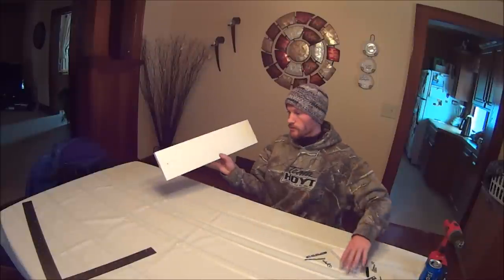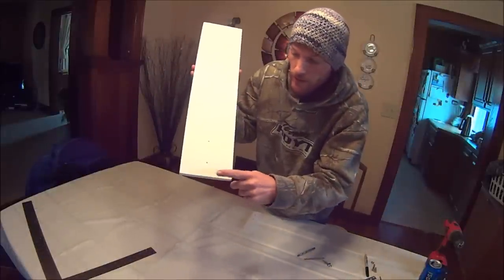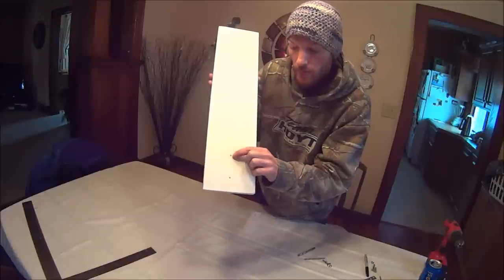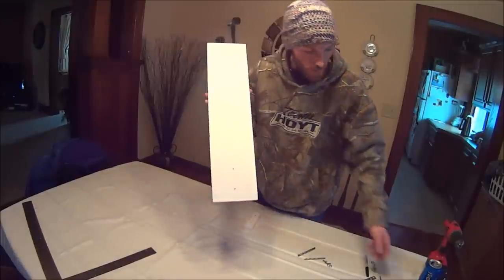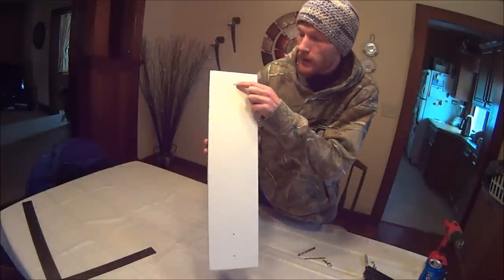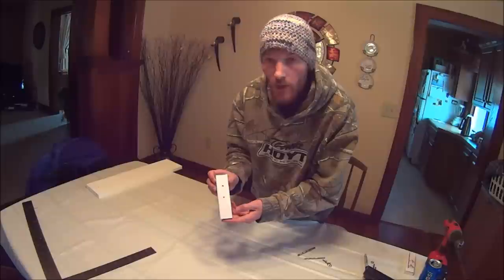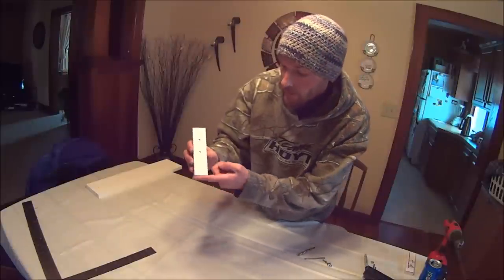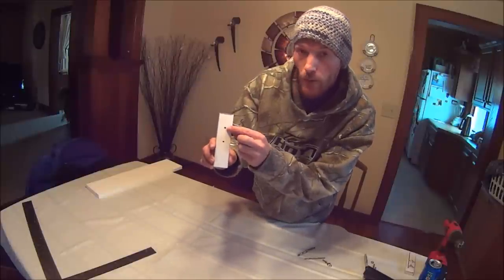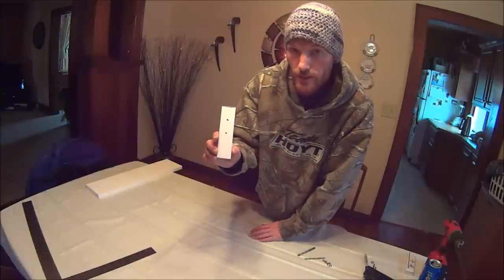Now that you cut your boards to 22 inches and 5 and a half inches, I am using this side of the board as my back. You want to find the center and make a mark at 1 and a half inches and 4 inches — these are your different holes to move your piece of conduit or PVC pipe for a longer or shorter rod. At the front of the board, find the center and make a mark at 1 and a half inches. Then with the 1 by 1 and a half, find the center and make marks at 2 and a half inches and 4 and a quarter inches. These marks are going to be the holes you drill out with the 3/16ths drill bit.